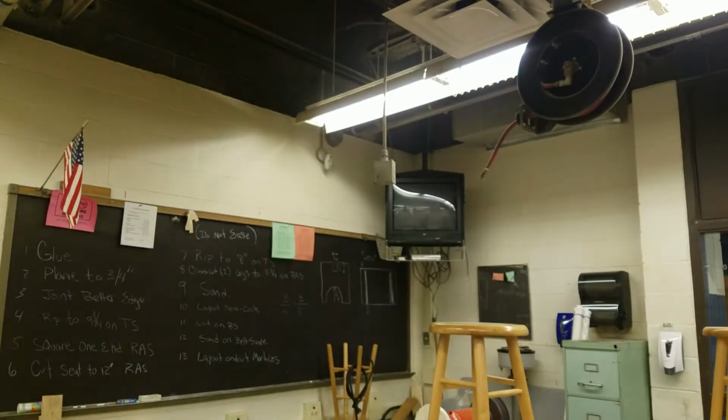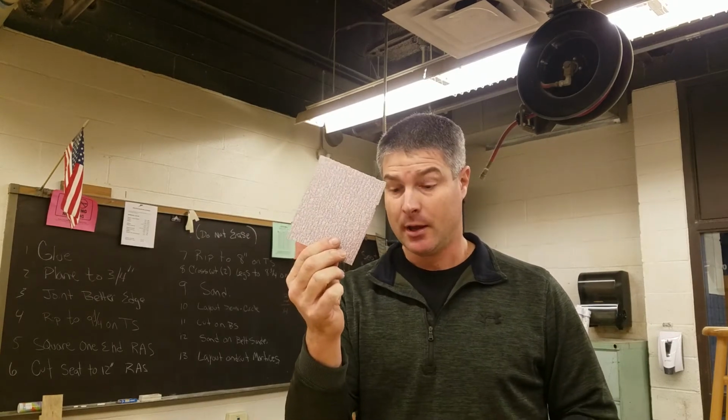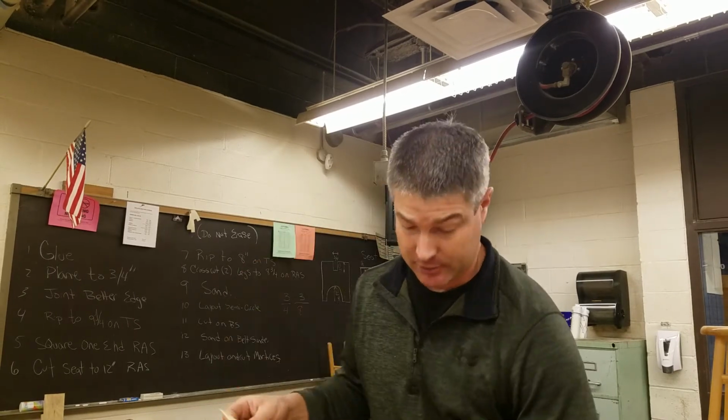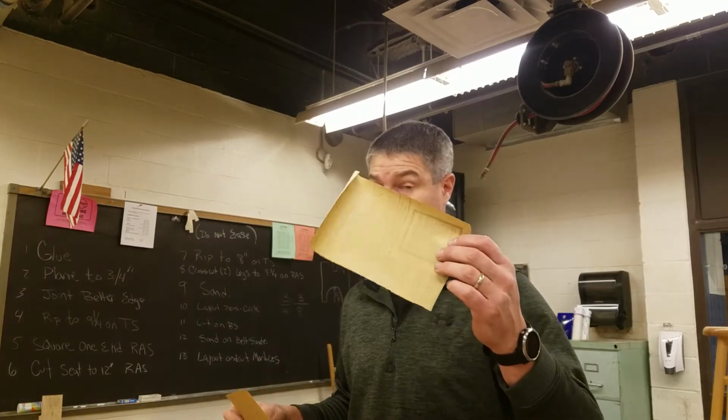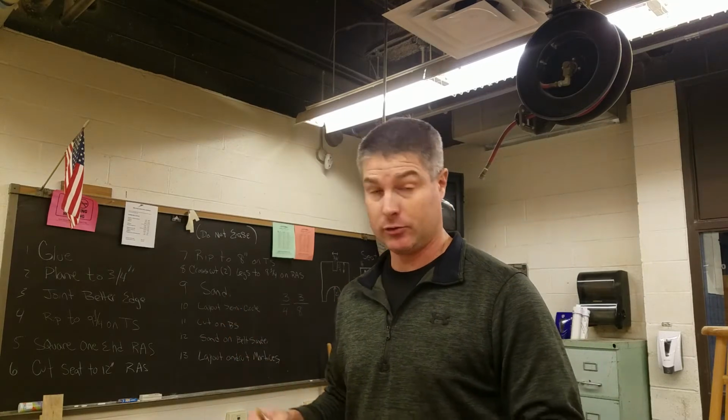So why does that matter? Think about it as lying on a bed of nails. Every once in a while you'll see a magician say, watch me lie on these nails. If you lie on one nail, it's going to poke through you, meaning it's more abrasive. Now, if you lie on 1,000 nails, or 220 nails like this 220 grit piece of sandpaper, it's going to more evenly distribute that weight across the object. So a person can lie on a bed of nails without it penetrating. It's less abrasive, okay?